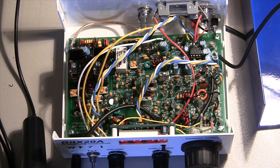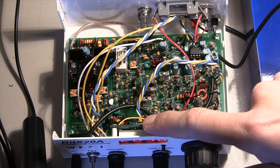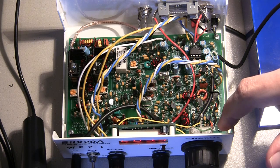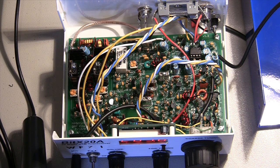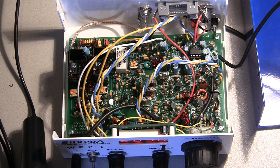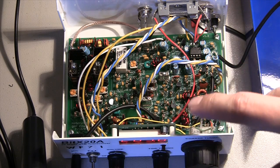Just a quick tour of the innards here. I've got an antenna hooked up so it's receiving 20 meter signals as we speak. The board is pretty small and pretty much everything is on the board — it fits pretty snugly in this box. The little display is screwed on at the front with a couple of standoff type things. The Polyvaricon main tuning capacitor is over here. To get a wider tuning range you can short together two of the sets of plates, which is what I did — that gives me most of the 20 meter band except for about 30 kilohertz.